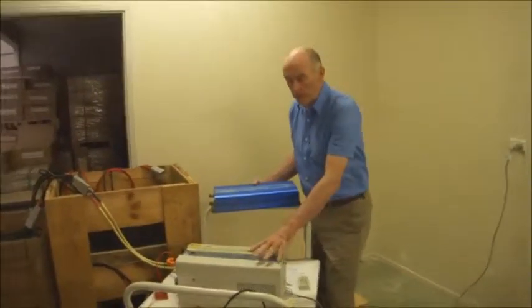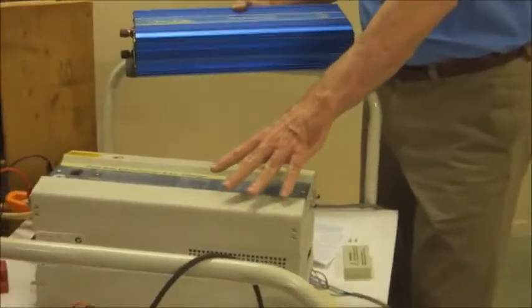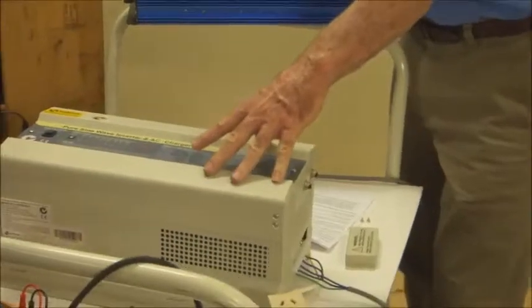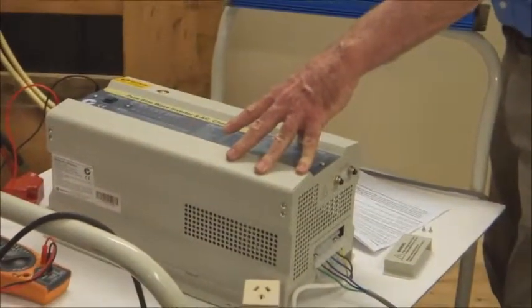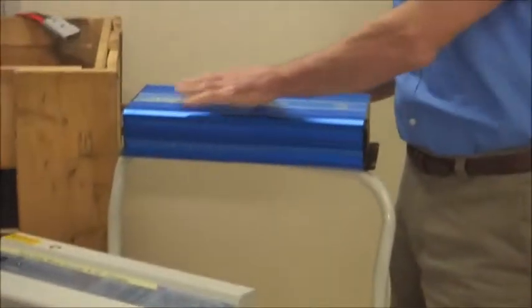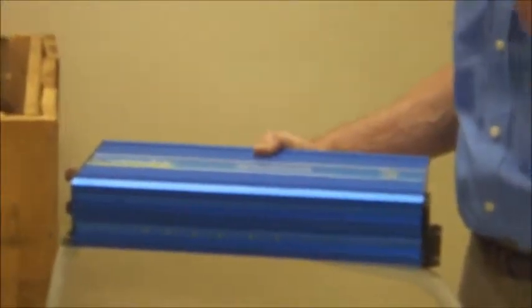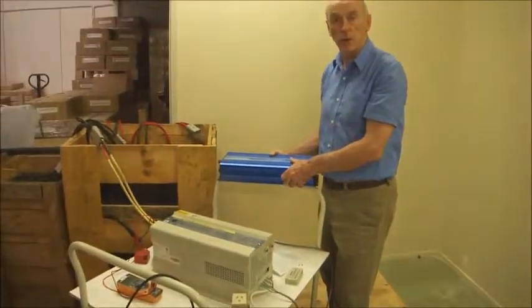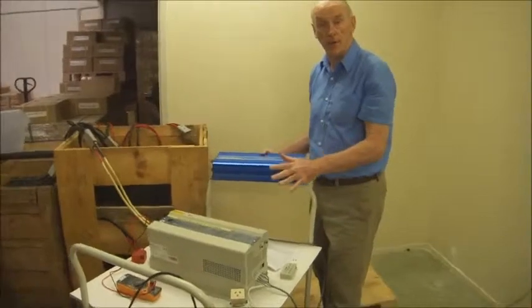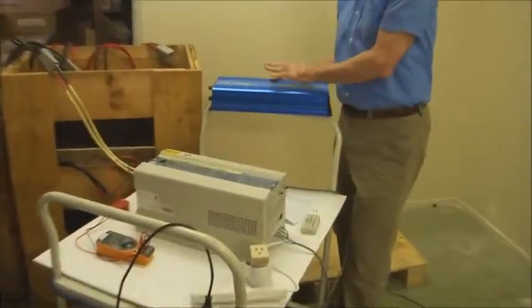One of the most important features of this inverter is that it's very rugged. There's very little printed circuit board and componentry inside it that can fall or break due to vibration. This one has a lot of chokes and small components which can break due to vibration and movement. This is relevant to when you use it in a motor vehicle, RV, or four-wheel drive vehicle. This is much more suitable. This is not suitable.